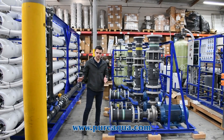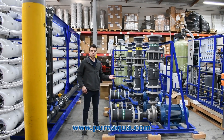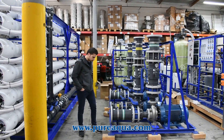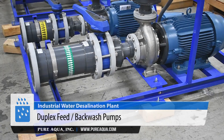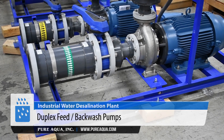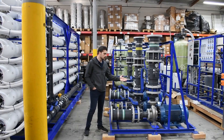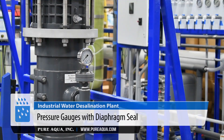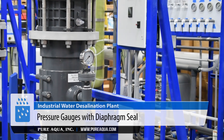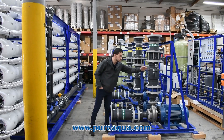Starting from the beginning of the process, we will have large storage tanks storing about an hour's worth of operation water. We begin with a 50-horsepower duplex 2205 feed and backwash pump, which will pressurize about 750 GPM to about 50 to 60 PSI. We have a pressure gauge here with a diaphragm seal, which will isolate the process from the stainless steel, giving it extreme corrosion resistance.